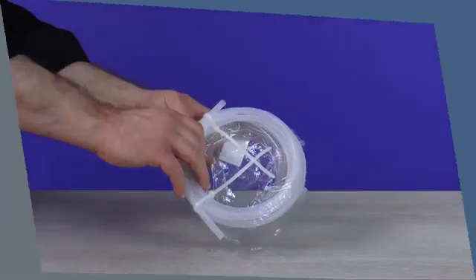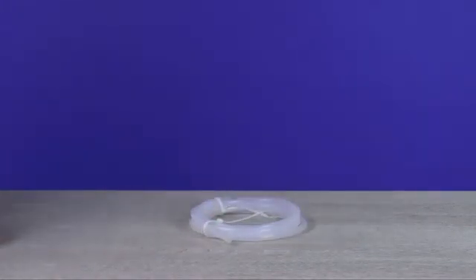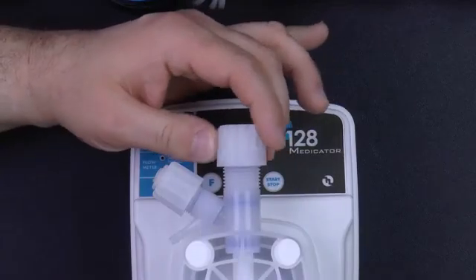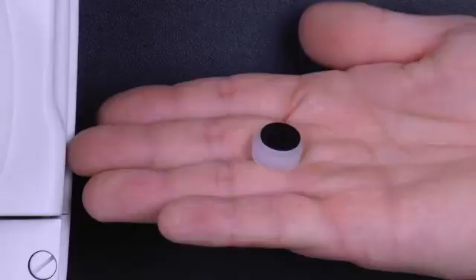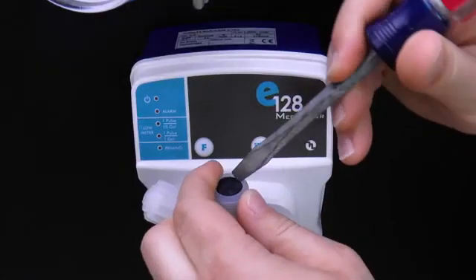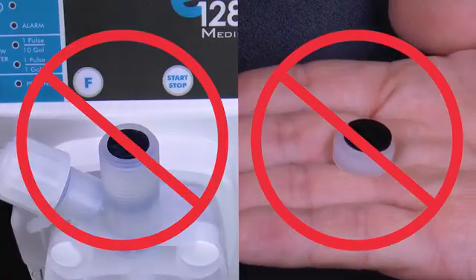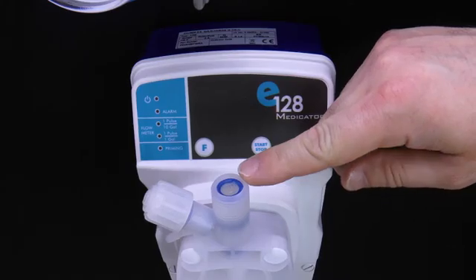Open the installation kit, take out the rigid polyethylene discharge tubing and set it aside. Locate the discharge valve at the top of the pump head. Remove the discharge valve tube nut, collar and nozzle, and set all three aside. Check to see if the black transit washer is stuck to the nozzle and remove it. If not, see if it is at the top of the discharge valve — you may need to use a flat blade screwdriver to remove it. Make sure not to lose the O-ring directly underneath the transit washer.